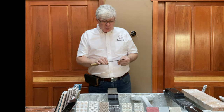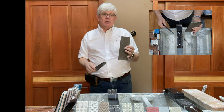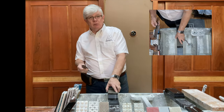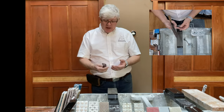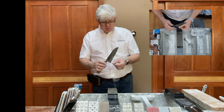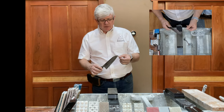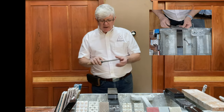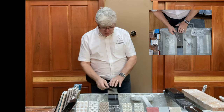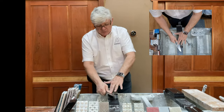I'm going to start out today with our 100 micron diamond resin. Right now it's dry, and I'm not going to put any water on it to begin with - I'm just going to start out completely dry. Now that we have assessed the knife and looked at it, yes it's rusted, doesn't really have any bad chips - well it's got one there. The tip's a little rounded, the whole thing is kind of rounded over. It's seen a lot of use. So we'll put it right down on the diamond resin and I'm going to thin it on the dry diamond resin stone.